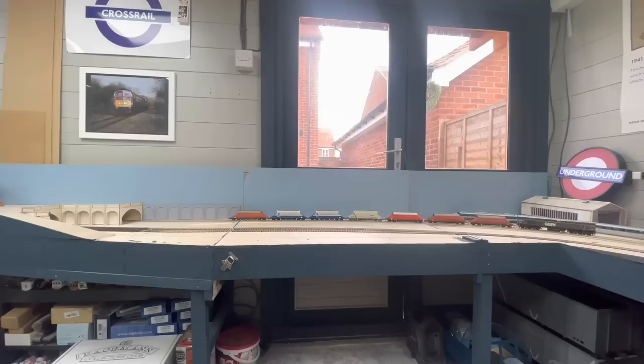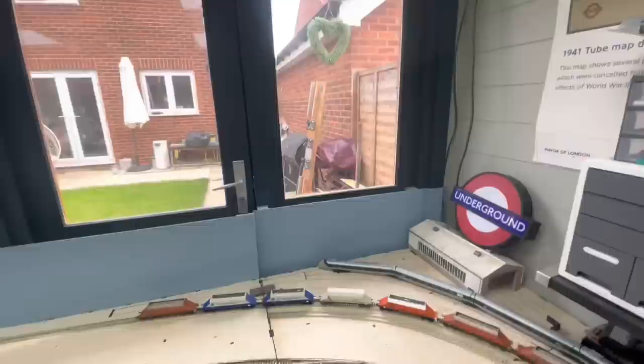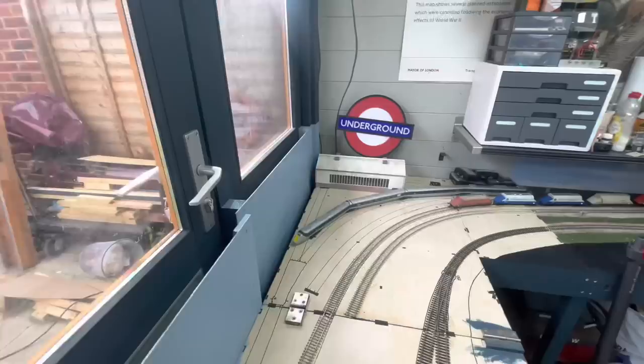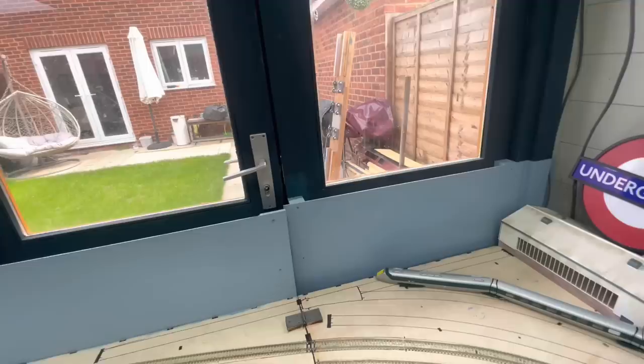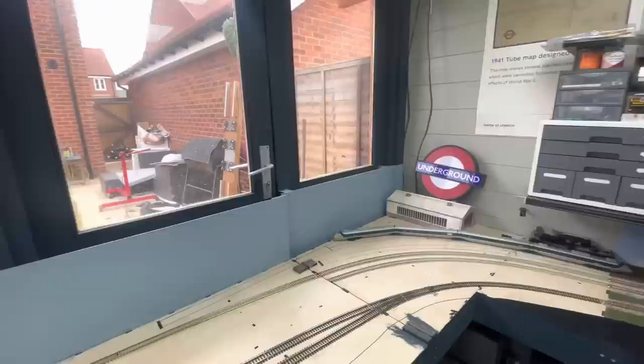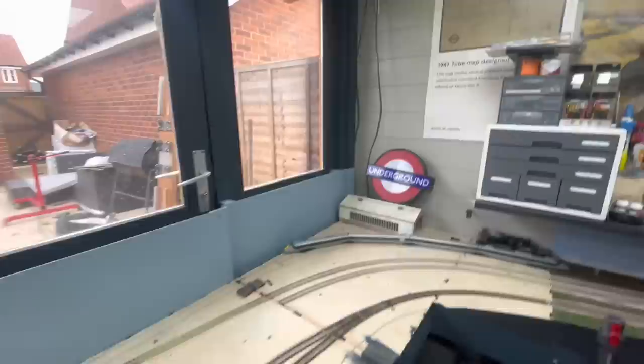You see the board here is stepped back. This one is actually screwed to the right hand door. Reason for that, again, obviously I can't have it flush with this one because this needs to pivot backwards, so it would get in the way. So you've got to have a gap for it to slide. And I've made this one ever so slightly longer, with a very small overlap, so that when you look at it from here, I mean, this is the furthest right you'll be in the cabin. The rest of the time you'll be over here or something. So when you look at it from them sort of angles, it does kind of look like it carries on. So it does the job, and I can still open the doors, no problem.